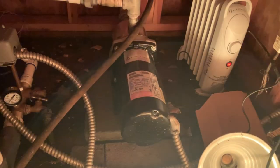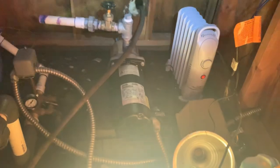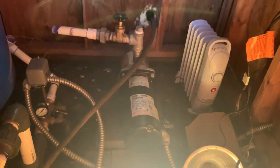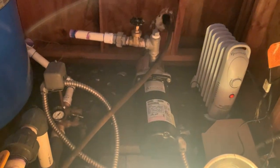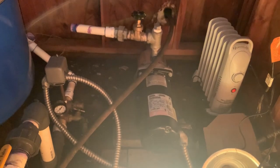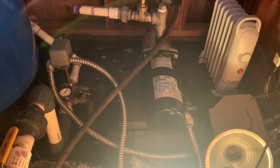The interesting problem was there is a breaker box on the outside of this wall, and that runs the circuit that goes underground all the way up to the house. Neither of the breakers had tripped, but we weren't getting enough voltage to run this pump. As I said, this is 220 — two hots coming in at 120 each on either end of the AC cycle. One hot was measuring at 120, but the other was only measuring at 60, so this pump was not getting enough voltage and consequently enough power to turn over. I managed to isolate that to a breaker that was broken, and I might take you back to the shop and we'll diagnose and see what happened to that breaker.